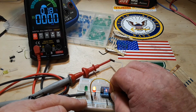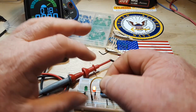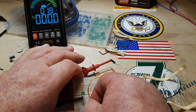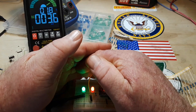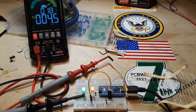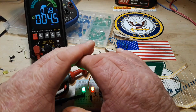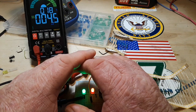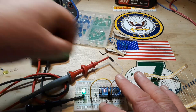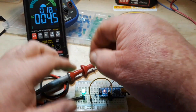Let's put the 510 resistor in and see if that might help them balance a little bit. See, that's balanced them out quite a bit more. And you can see now we're only drawing 4.4 milliamps. Could you imagine five times more output? It would almost blind you, especially if you put in a blue LED, which are incredibly bright.